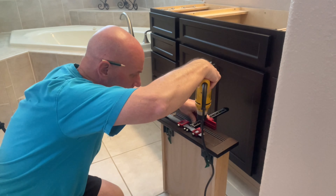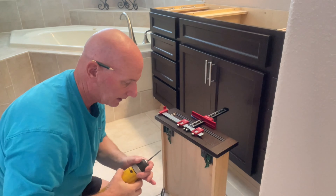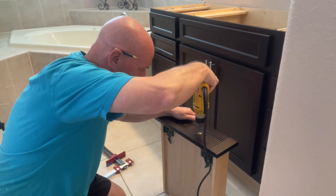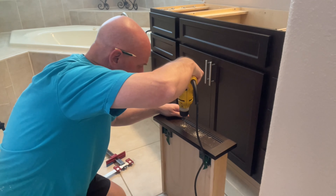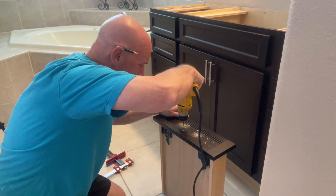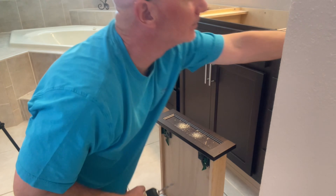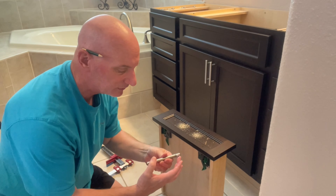These drawers — the face frame from end to end is 16 inches, half of that is eight inches, and the height is five and a quarter, half of that is two and five-eighths. I have it all set up. The most important thing with this jig — it's not expensive, about 18 or 20 bucks — is to make sure it's completely steady and stopped from moving. The other thing is to make sure your drill is completely perpendicular, straight up and down. Take your time with it.